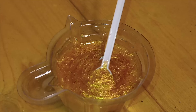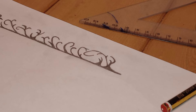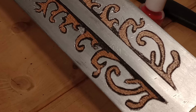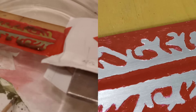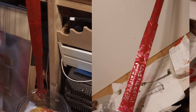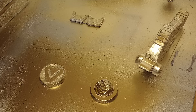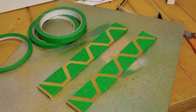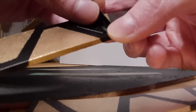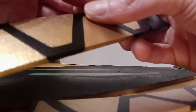Next I'm making a mold and casting a custom piece — this is going to be the head of the lion for the Red Ranger. I'm also working out how I want my design of the engravings that go into the blade. I'm not going for exactly the original design, I'm kind of going for an inspired look. Now we're acid etching using some ferric chloride to etch into the actual aluminum itself. And now the final step is spray painting everything and making it all shiny and gold, doing a bit more detailed masking off. We have these awesome lines — very close to the original but not exact, and I really do like how these came out, very clean.